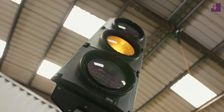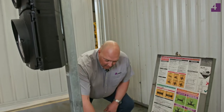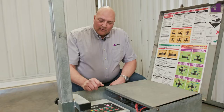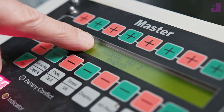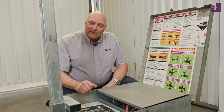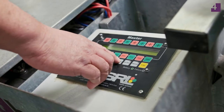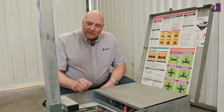We're going to go to our slave unit first of all. Switching on — press the on-off button, wait for the screen to come around, and on the screen it should say signal number two, and it should say radio. After that, we need to go through our display and make sure that we've got correct battery power. This one's reading 12.25 volts, so we know the 12-volt system has plenty of power. Take note of the channel — this is on channel 30.